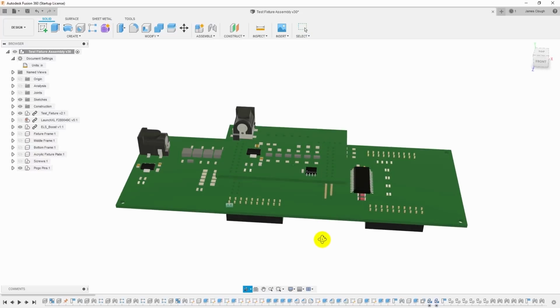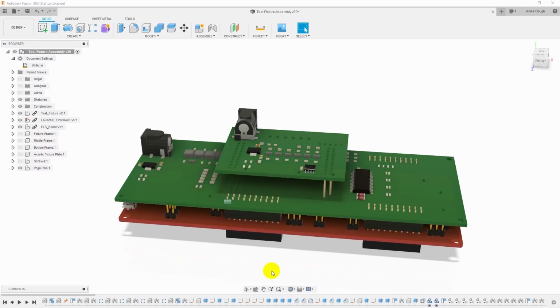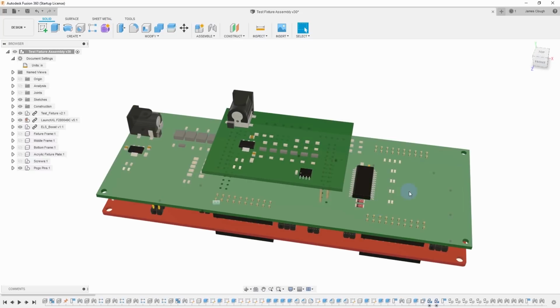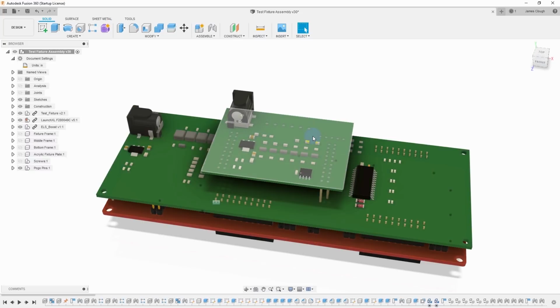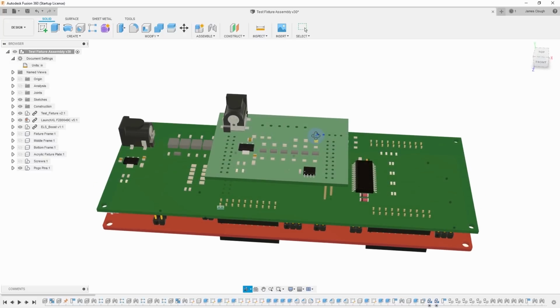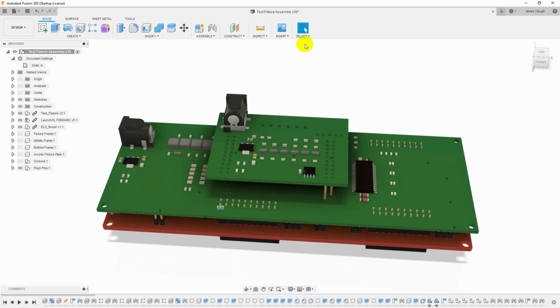And this is all going to sit on top of another launch pad board. So the launch pad board will be running the firmware, and this is the interface test fixture that will be used to test the PC boards before I sell them, so I can drop every board on here and it'll run a test ideally in a second or two and then display the status on these red and green LEDs over here, and then I know the board's good.